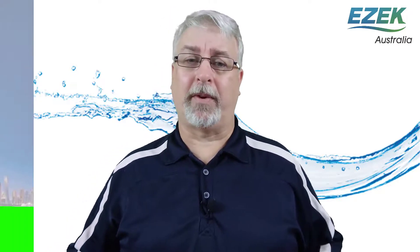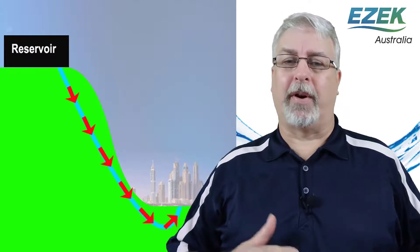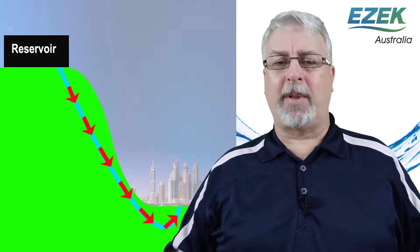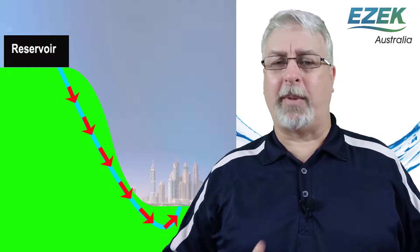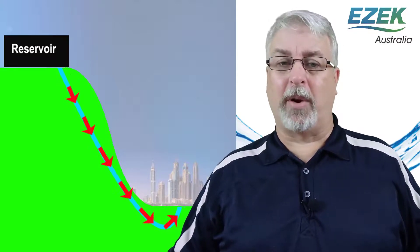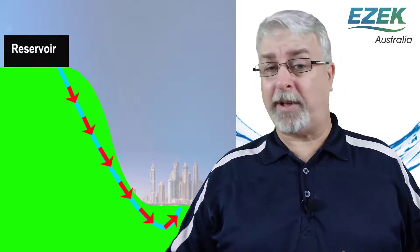There is some variation in water pressure across shires and sometimes it can be a bit higher. The usual way water utility companies create water pressure is to put a reservoir on top of a hill. All that water gathering up the hill creates pressure, but the amount of pressure varies depending on the height of the hill. They then use valves and so on to regulate it further, but there's still some variation depending on how many people in the vicinity have taps turned on, if the area has grown beyond the infrastructure, or if the infrastructure has been designed for growth that hasn't happened yet.